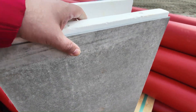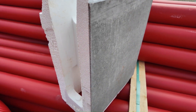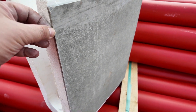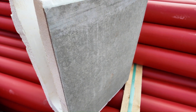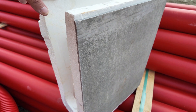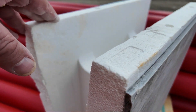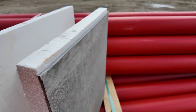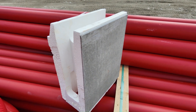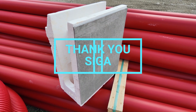But that's not the cool thing about this ICF — I've never seen this before. This one actually has a cement panel adhered to the outside, so you can put it up and they simply have a little H-channel that you push on to secure it. That is just a cement board, so now you can put this ICF as the top course and that gives you that very durable finish. It's probably on the order of about three-sixteenths to a quarter of an inch thick — I have never seen anything like that before. A fully integrated finished panel on top of an ICF — very cool.